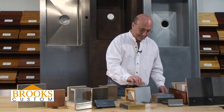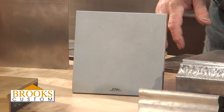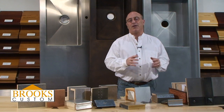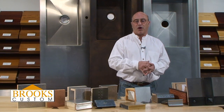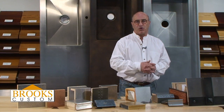This is matte finish zinc — that's raw metal. There's no lacquer coating. That will oxidize in time and just kind of be dull. It can react with certain foods. Strong vinegar, if left in a puddle, will turn that dark. Generally, you can remove those marks with a Scotch-Brite pad and a good scrub. You will never wear through your zinc at 14 gauge. It's a very heavy metal.